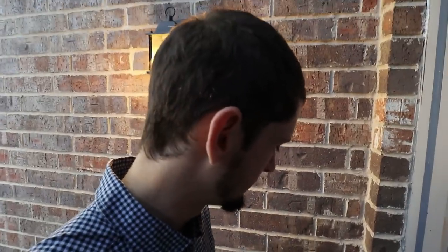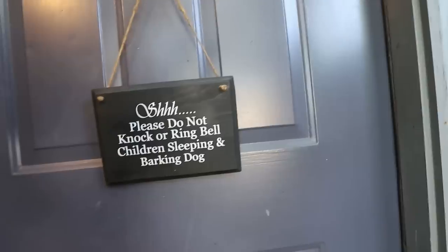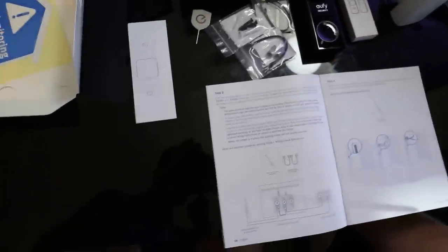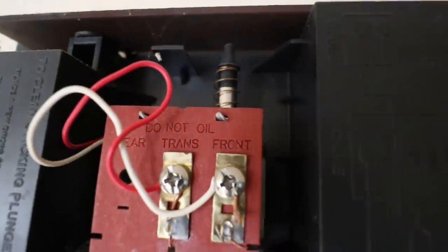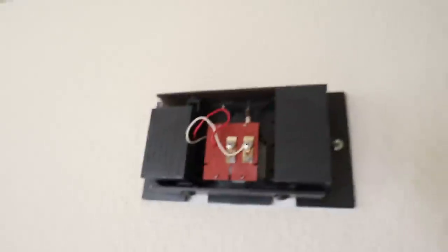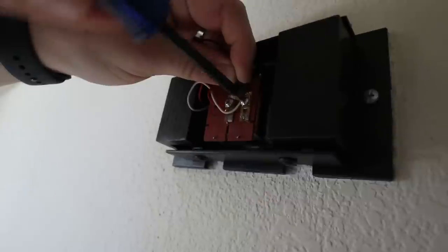The people inside were alerted that I was ringing the doorbell. Now we're going to find the doorbell chime. They're even labeled 'transformer' in front — this couldn't be easier. All you've got to do is jump those two terminals. Do we need to check and make sure we're getting the right amount of power? Maybe that comes up in the instructions. For Ring, there's a certain amount of power you need.